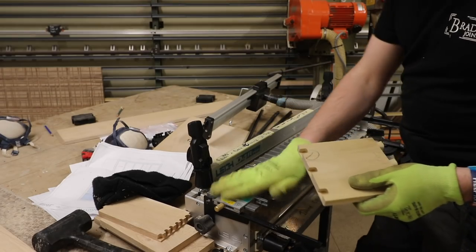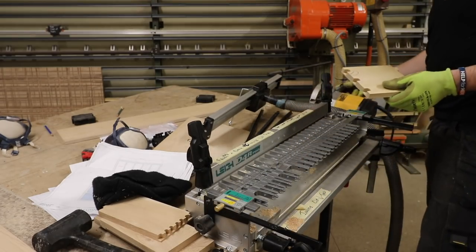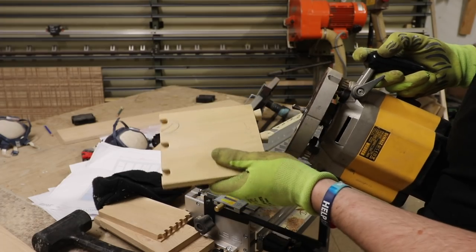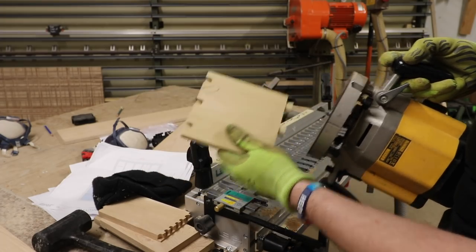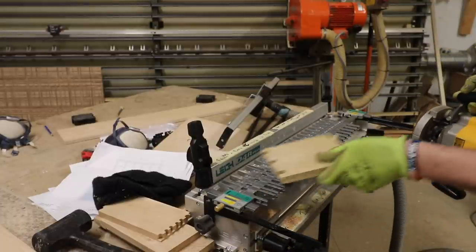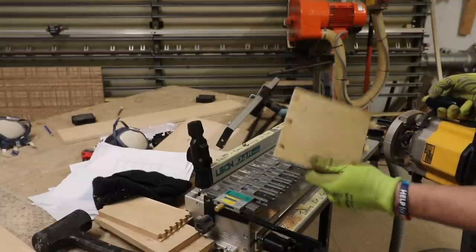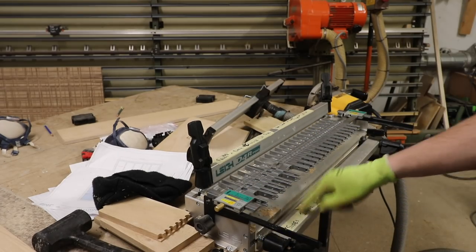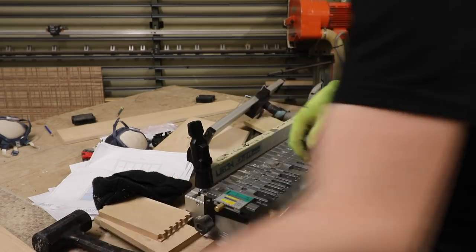Out with the jig again, same as the drawers. So easy to set up. Just a known good dovetail. Set the cutter height off the pins to a known good dovetail, so put it in the thing, put your router on the pin, set that height. Then put it in the tails mode, so you're working on your tail board.